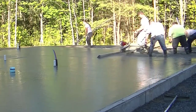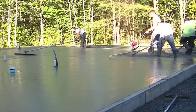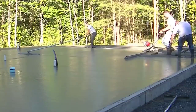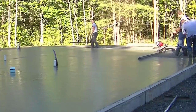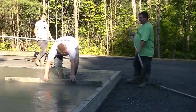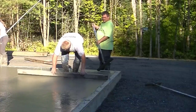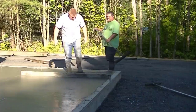You can see the speed I'm going finishing up this last bay. All in all, this was about a 21-yard floor and it took us about 45 minutes to pour the whole thing — partially hand screeded and partially power screeded. The Screed Demon weighs about 35 to 40 pounds, not really that heavy, so it's pretty easy to move around. To finish out this last little piece, we'll show you Luke bending over and hand screeding. If you like this kind of stuff, give me a thumbs up — appreciate you watching, subscribe to the channel, and we'll see you on the next video.